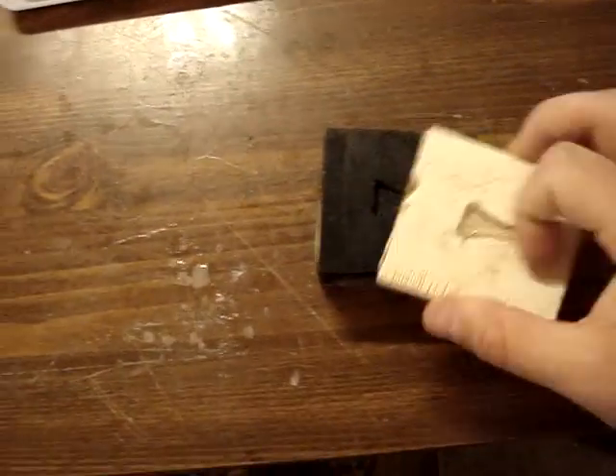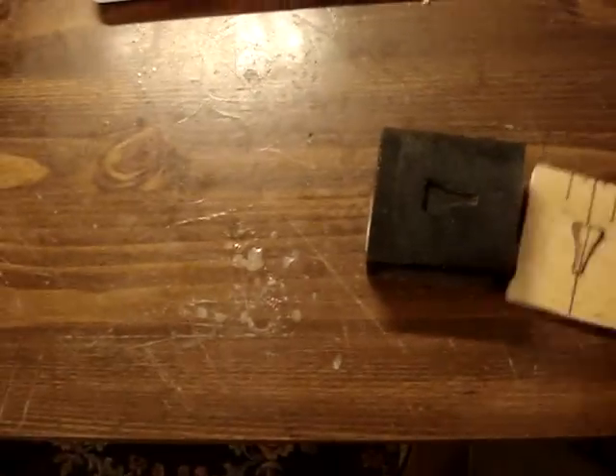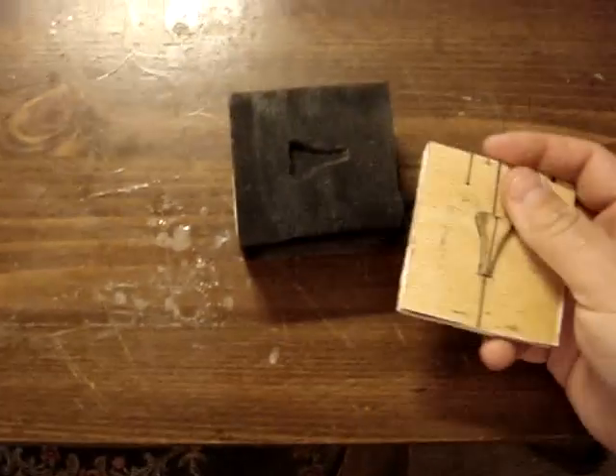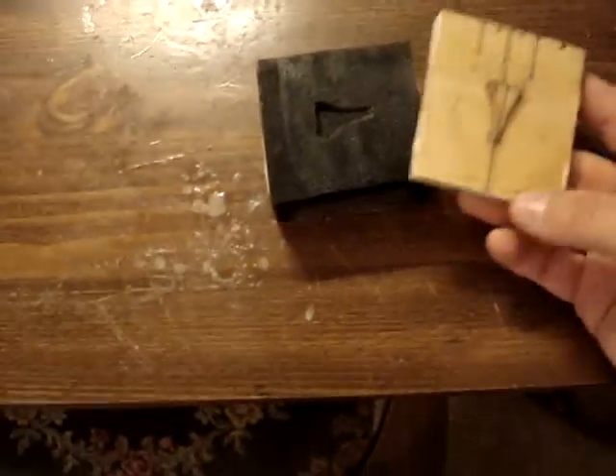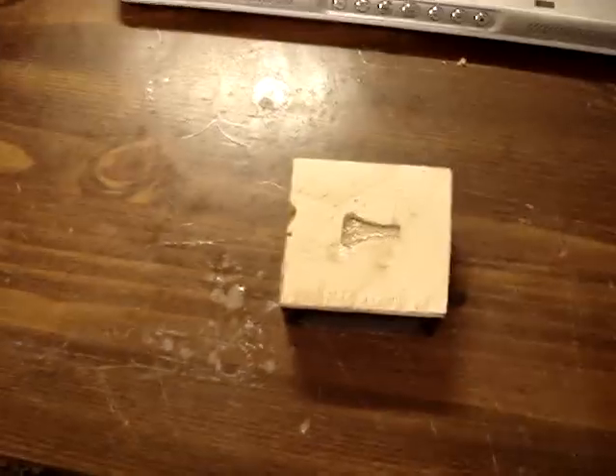Then you can put the litho on top of the rubber mold, put your plywood on top of it, just smack it with a hammer, and rinse and repeat for the second one. The little ones are a little bit harder to do. For all the NACA ducts, I had to anneal it twice — annealed it the first time, put the rubber on there, stuck it down, hammered it about two times, pulled it out, re-annealed it, and did it again. It took about eight tries for the little ones; the first ones I got on the first try.